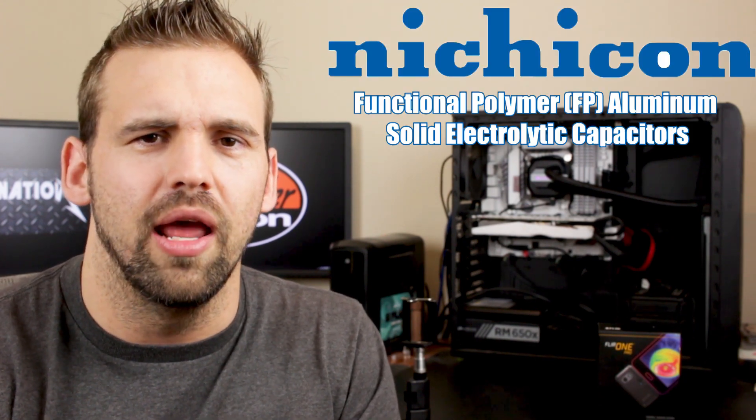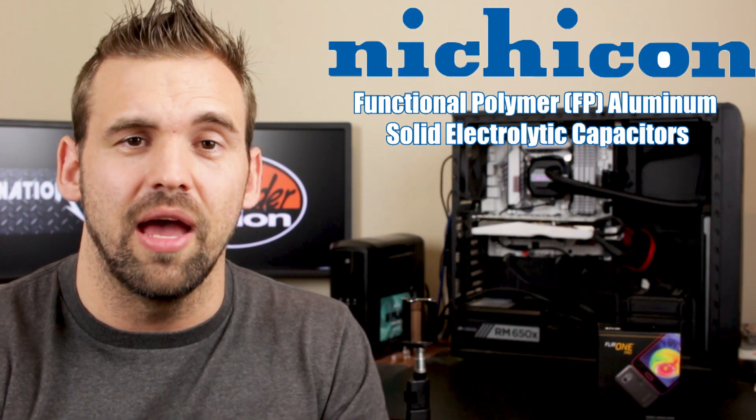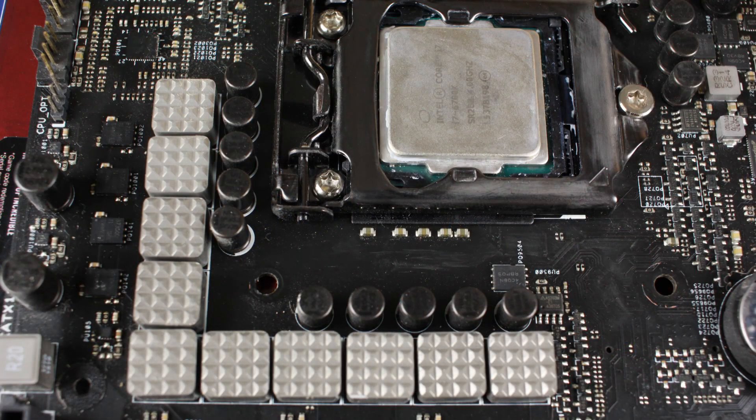ASUS said: 'We are pleased to advise you that the capacitors are 10K black capacitors, but we do not know the temperature for them.' That wasn't very helpful, but the fact that they are black capacitors rated at 10K is useful. Going on the ASUS website, I discovered that ASUS uses Nichicon — I'm not sure how to pronounce it — which is a very high-end capacitor. If we assume those Nichicon capacitors are being used, they are rated at 105 degrees Celsius, which means that's the temperature they can withstand in continuous operation. So as long as we are below 105 Celsius, the product should operate okay.